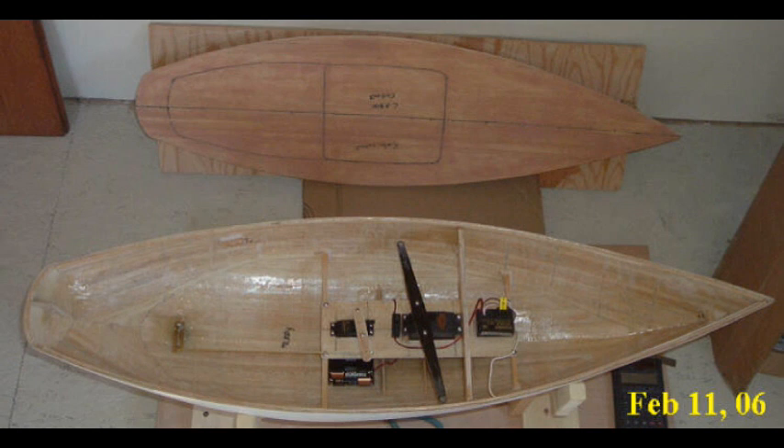The Futaba 3003 has a power of 44 inch-ounces of torque. It is connected from the control arm — a piece of fiberglass-reinforced balsa wood screwed to the control head on the servo — via a brass rod to the control arm on the rudder itself. Just below that servo in this picture is the battery holder; it originally had four AA alkaline batteries, but later I switched to rechargeable NiMH batteries, and more recently to lithium batteries because they last longer and provide full power for longer.